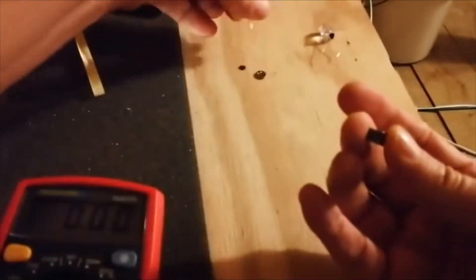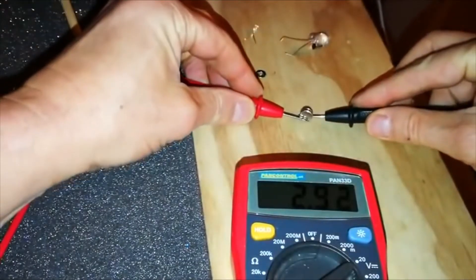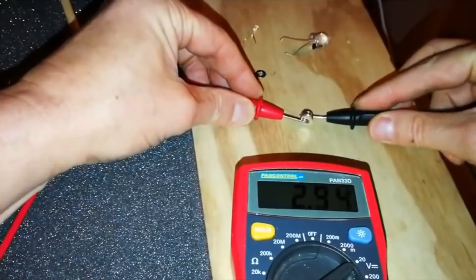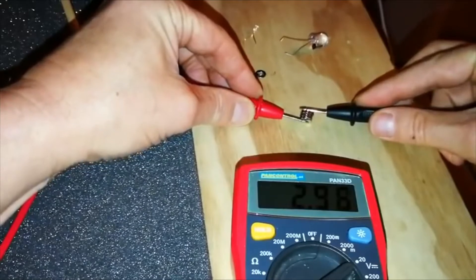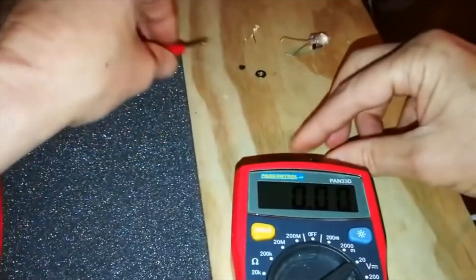Let's see what happens when we put an LED on it. Don't tell me you can't get it to work. Let's take something with a bit more wumpf in it, shall we? There you go. So how much voltage is coming out of this? I'm going to put it in there, move the Evo in, whether it says plus or minus. And there you go — I would say I've got three volts there, or a fraction under. 2.9, in fact 3.3, 3.4 volts. So 3.4 volts out of six half-millimetre magnets, a bit of paper, and a bit of copper. No trickery whatsoever.